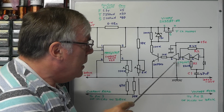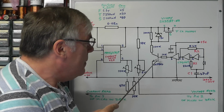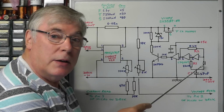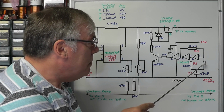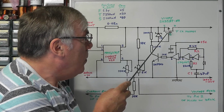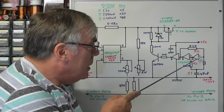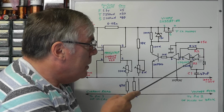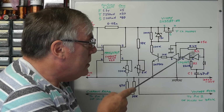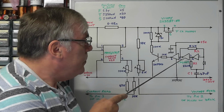Now this part of the circuit here forms the little bistable that drives the transistor, and it's this that is controlled by a little tactile switch here. So the tactile switch is simply acting as the on-off to control the P-channel MOSFET. And basically what it's doing is we're using two inverters there with positive feedback, which is the R2 resistor 5.6k, as a little bistable latch.